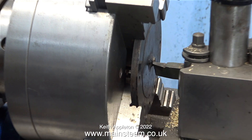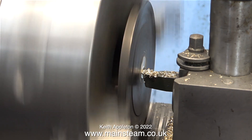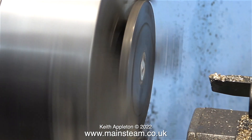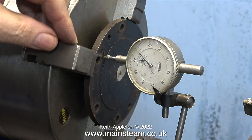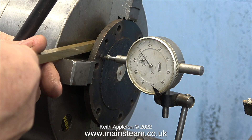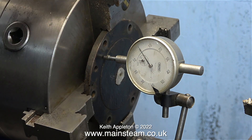I'm going to level up the entire centre part of this cylinder cover, but for the moment I'm just removing the nut in the centre. It's a brass nut and the brazing material is very similar, so it cuts really easily. I made a few gentle passes and turned away the nut entirely - the nut wasn't in the centre of the cover so I'm glad to see the end of it. I think at some stage in the past this engine must have had an ornamental cover fitted. I need to machine very gently all the way across the rough casting, and I'm using a piece of brass bar to move the cylinder cover away from the chuck. By repeating this process all the way around I finally get the cylinder cover to run true, with the DTI pointer running over a layer of paint but very close indeed.